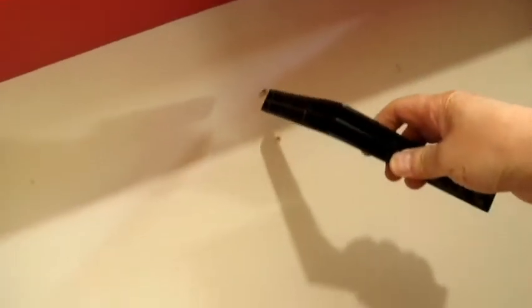I'm going to use three brackets. Normally you would only need two. But the thing is that the stud is right in the middle here, and I know that because there's a screw right there.